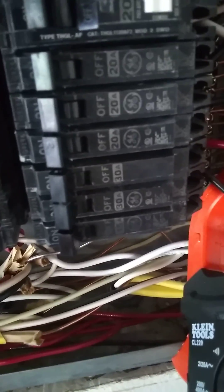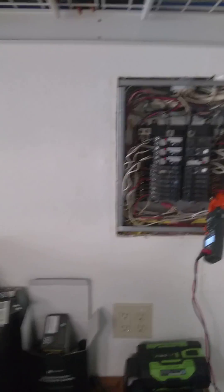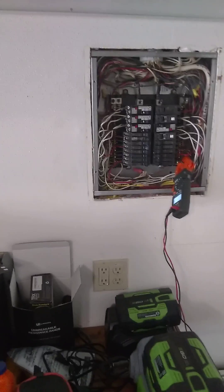It's rated up to 60 amps, so it would trip. And I feel like this particular GE breaker, even though it's rated for 30 amps and is only pulling 23 amps right now, it's just heating up way too hot. I'm kind of upset because GE is a company that's been around for a very long time and their breakers are overheating and malfunctioning any time they have anything to do with an EV charger — and these EV chargers are well within the spec of what the breaker is rated for. The thing is just way way too hot to the touch.